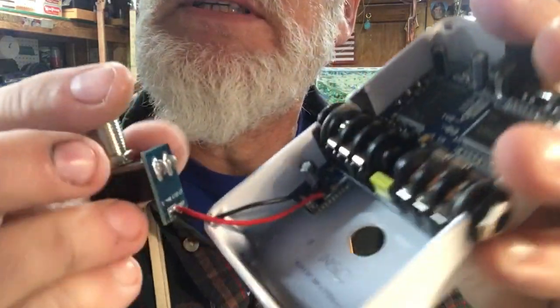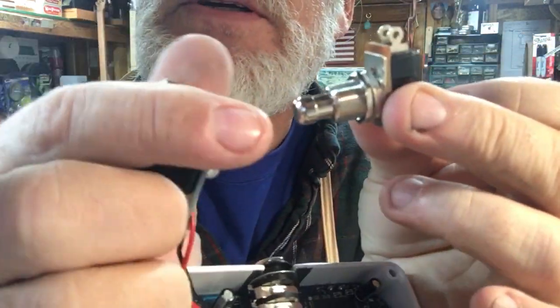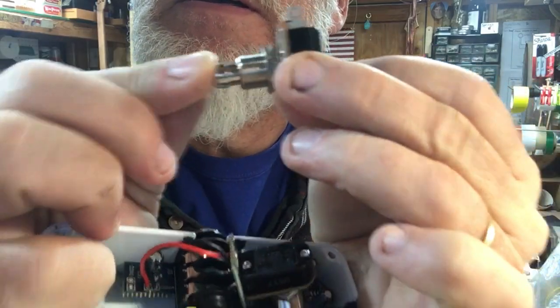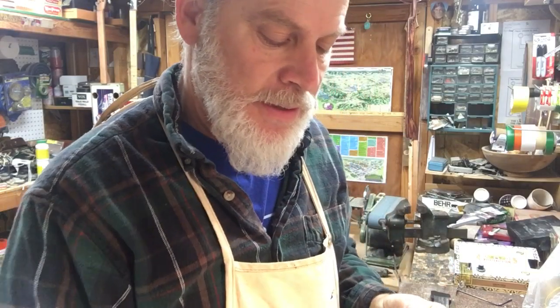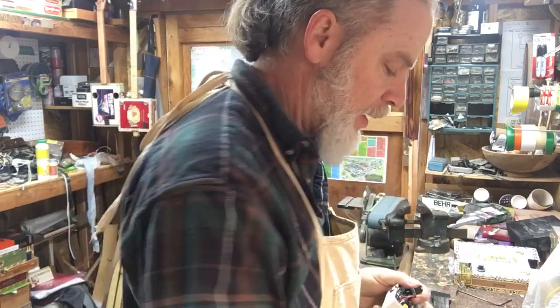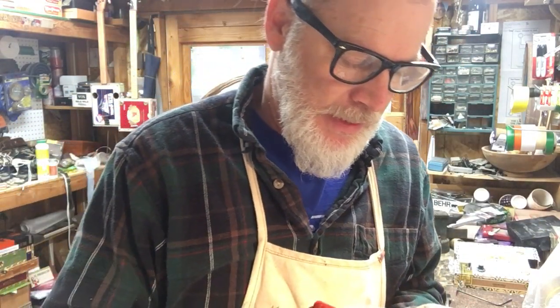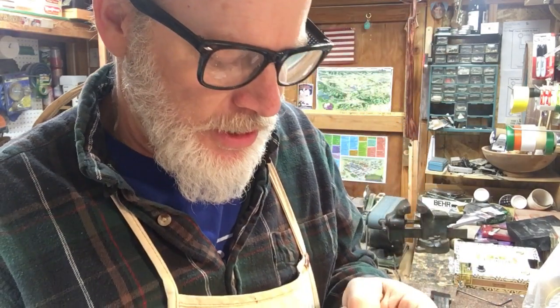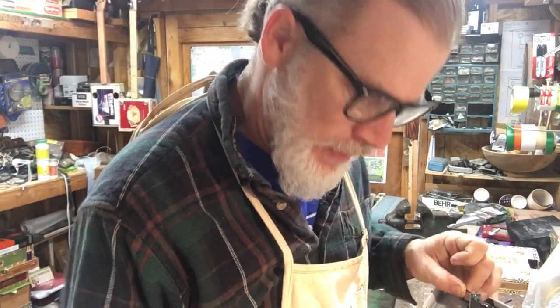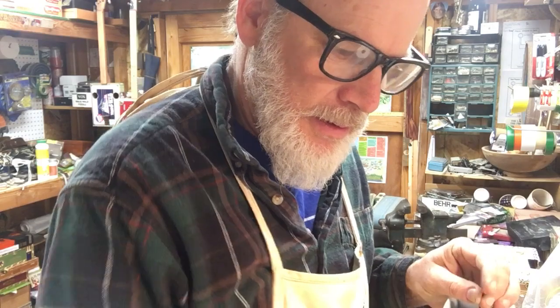So I'm going to desolder this dude and solder in this dude. So that's what I'm gonna do right now. I've been heating up my soldering iron and it's hot. I need my reading glasses. Okay, here we go. Now with these switches, it doesn't matter which is red because they're just a momentary switch. So I'm just gonna take it off. I don't even need it soldered. I can just cut it with wire cutter. And then strip it.